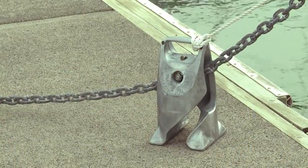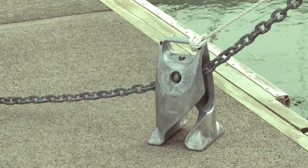We find if it's blowing about 20 knots and we know it's going to get worse, we'll put our Anchor Buddy on for the difference that it makes. It stops the swing of the vessel amazingly. It dampens all of the excessive boat movement that is normally transmitted through to the anchor, and that can cause it to roll out and dislodge.